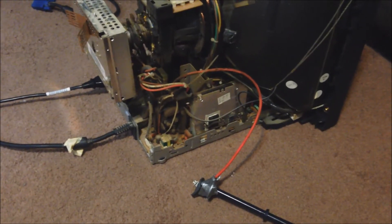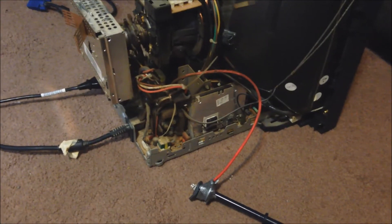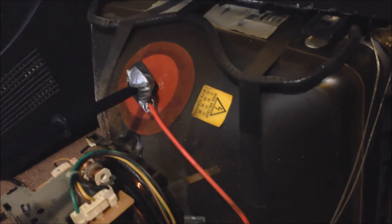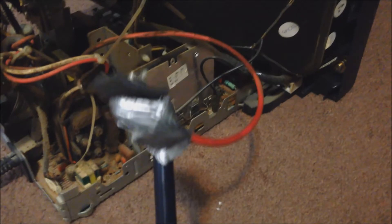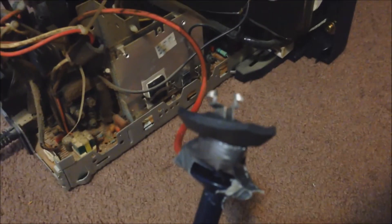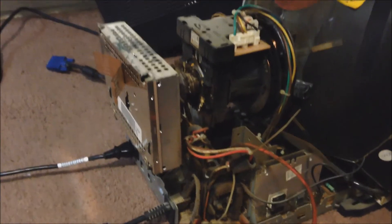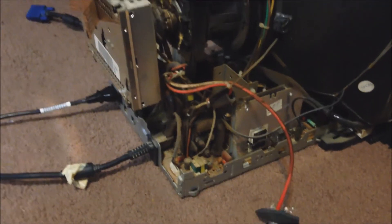This is the easiest way to play with a flyback transformer — simply take the cover off an old television or monitor and turn it on. What I've done is take a plastic handle and tape it to the end where the flyback outputs to the monitor. I trimmed off a lot of the plastic shielding so I could see better. Since the case shielding should be grounded anyway, I'm just going to arc it right up against the case. We've got a handy on/off switch, which is always nice.